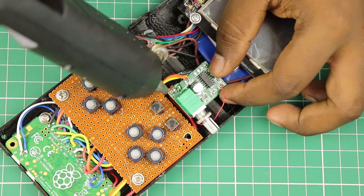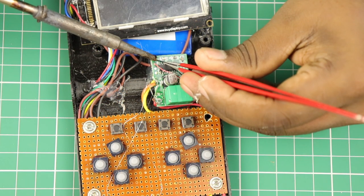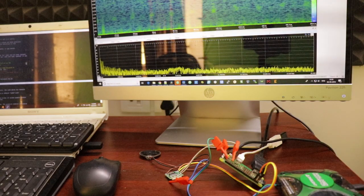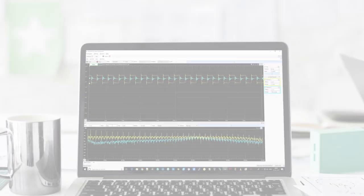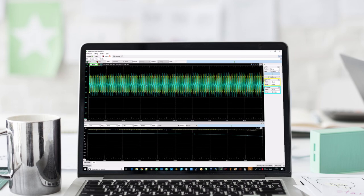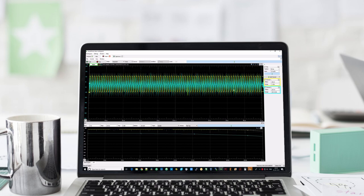I will use a screwdriver to adjust the volume if required. I have connected the audio output of the Raspberry Pi to the amplifier directly, but I can hear a steady noise signal coming from the speakers even without any activity. If we analyze the signal, we can see that this is not a pure analog signal coming from a digital to analog converter. Instead, this is a pulse width modulation signal — you can see the PWM square wave on the scope.